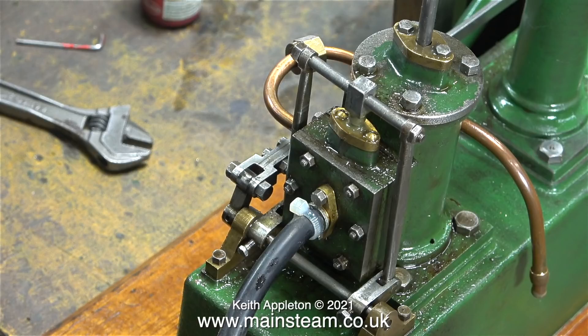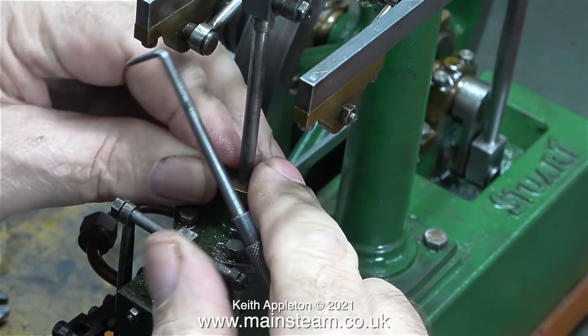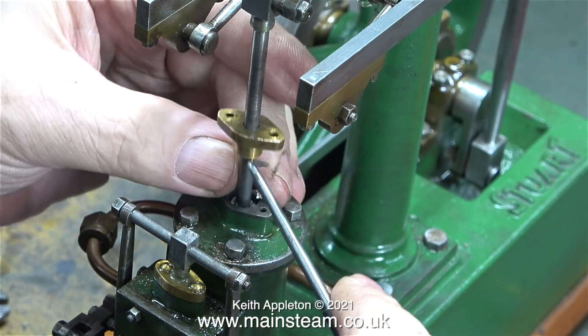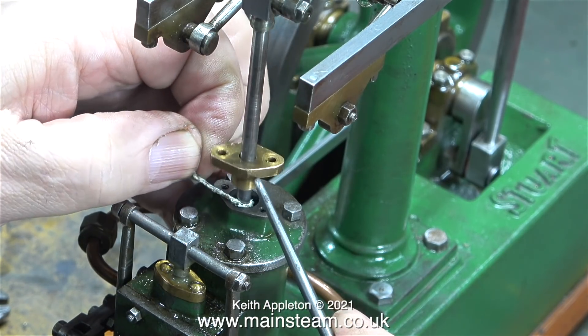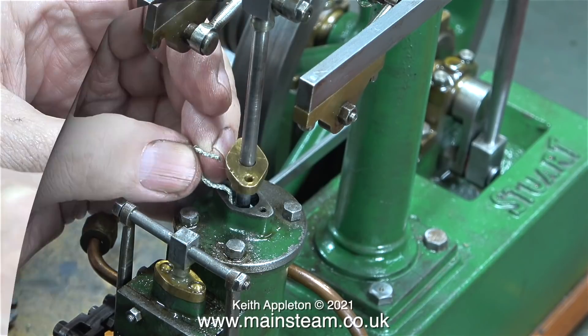The good news is I contacted the owner of the engine and I've got the job of repairing it. I'm going to start the job by packing the glands. The stuffing glands on the cylinder and the steam chest are designed to prevent steam leaks from around the piston rod and the valve rod, but on this one there didn't seem to be much in the way of packing in either of them. This clip shows me packing the gland using some teflon coated yarn. I use teflon coated yarn these days because I do not like the modern graphite yarn. I think the old type of graphite yarn that we all know and love probably contained asbestos.